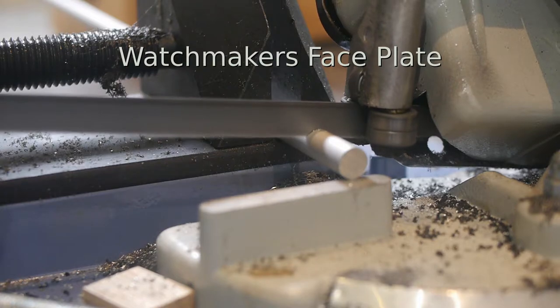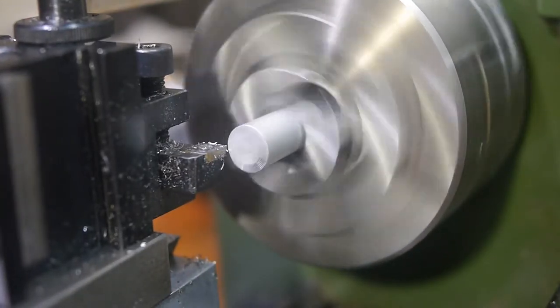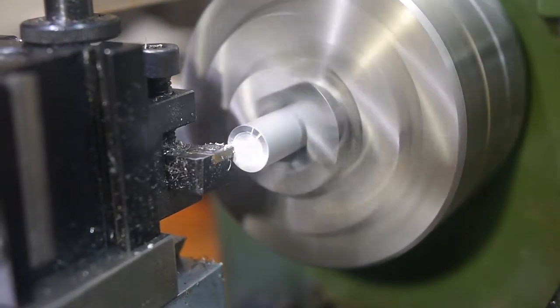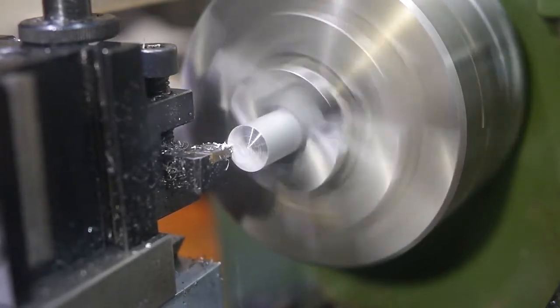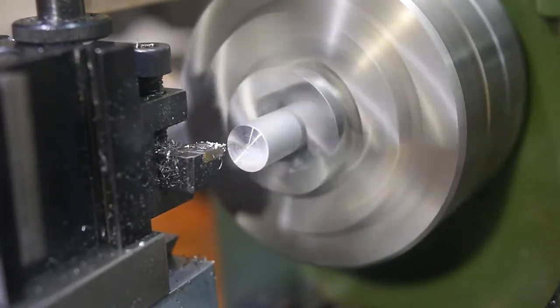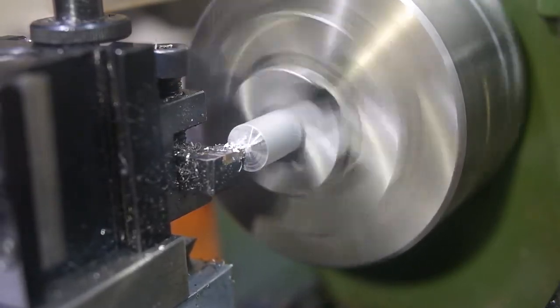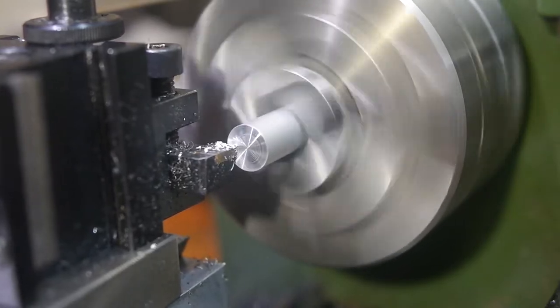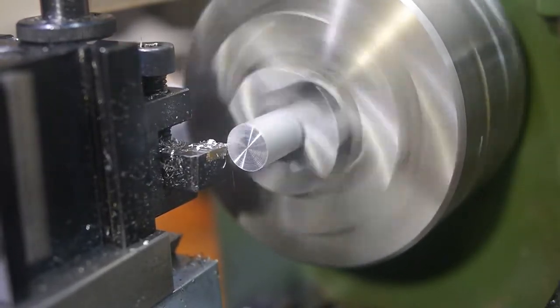In the previous episode, I cut a curved slot into the plate while it was clamped to the rotary table at a single point. While it remained secure for the duration of the operation, this isn't good practice, and a viewer pointed out I should always hold the work at least two places when milling. In my most recent video, I started work on solving this problem by creating some custom T-slot nuts for my rotary table. There is plenty of detail on why they are required in that video, so head over and watch it if you haven't already.